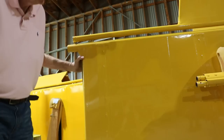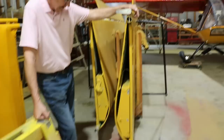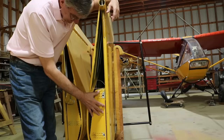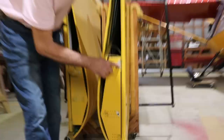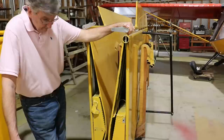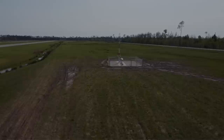Having built a more useful bush plane, we needed range. So we designed and built our own in-wing tank kit, which comes with the SJ as part of the package and is also available for the DR kit. The tank has 3 ports — two for the tank indicator with a forward port and a rear port going down into the fuselage, then to a set of valves going to the engine. You could have a header tank if you wanted. This tank has become really popular and people are buying them for other airplanes as well.